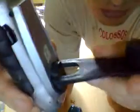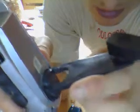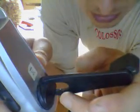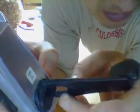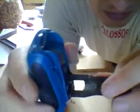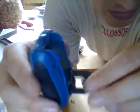This one, for example, has its handle not in the center, as you can see. So this is no good, and you should make some kind of connection to disassemble this and find a way how to connect. You could make some kind of piece of wood and screw it, or bolt it rather, preferably, with 2 screws from the inside, and that piece should have a bolt in it, and then with a flexible plastic hose it could also function. But it is always advised that there is some flexible coupling between the generator and the shaft. Also in real engines they have this. Of course this is not a real engine, this is just a windmill. And in the future we will make bigger generators which produce more interesting energy, but this is just the experimental stage.